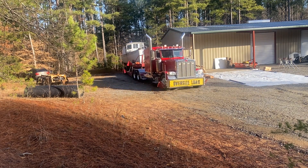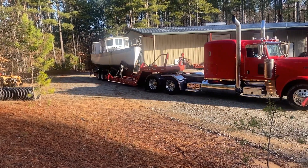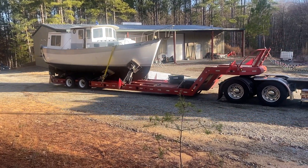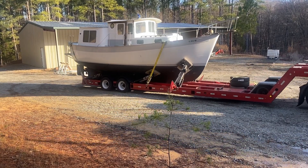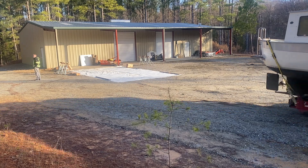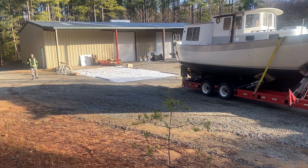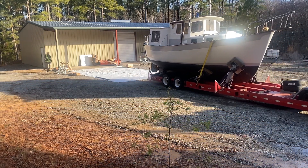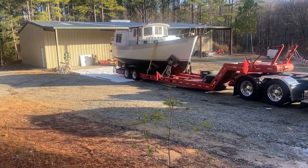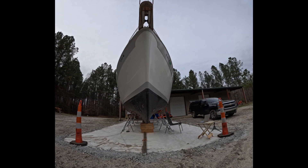What an exciting morning that was. The boat was finally there — I could probably do a whole episode on boat hauling in itself. It's a big deal. We literally worked to the last minute finishing the keel blocks and the tarp the morning it showed up. Then it was time to start thinking about the shelter. Paul and I discussed it, and I decided on a Gothic arch style because of the wind load and snow load it would have to withstand and to last the duration of the rebuild, yet not cost a fortune. You can find lots of plans for Gothic arch shelters — they're commonly used in boat yards — but I chose to make my own.